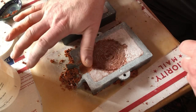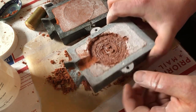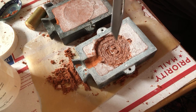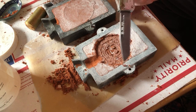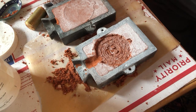I'm not sure how well this is going to turn out — there's a lot of fine detail in this cast and it's very thin, and a couple of pieces came loose. You'll be able to tell there's a skull in there and some kind of design, but some of his teeth, eyes, and parts of his nose didn't quite make it — they stuck in the plastic form because I didn't put enough powder on them. But I actually think that might look kind of cool, being a little jacked up like that and giving it a little more pirate authenticity.